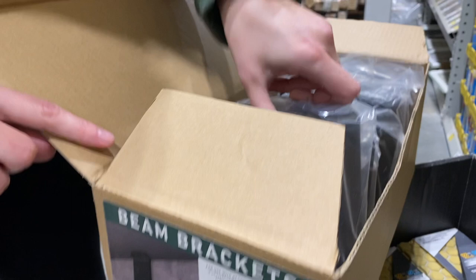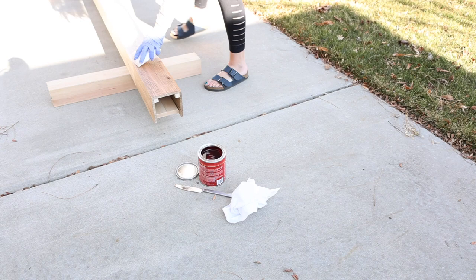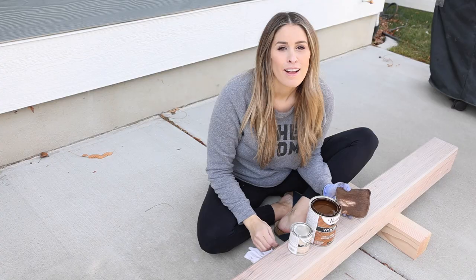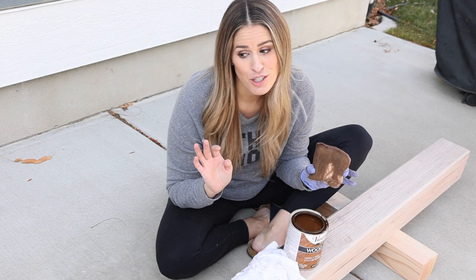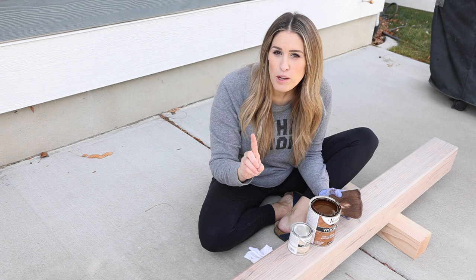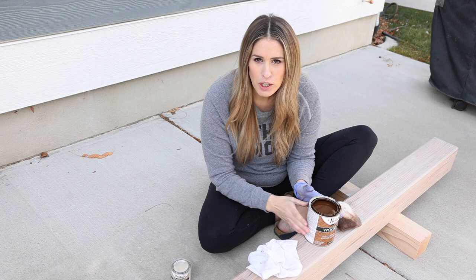I also picked up two of the ornamental seam covers and I'll show you guys what I did with those later in the video. Back at home, I prepped my beams to be stained. I started with a pre-stain wood conditioner, applied it with a sponge, but you could also easily do it with a rag. Let me show you guys the process I used for staining my beams. I tried this color combo on another project I'm working on for Hill's House and decided don't fix what's not broken, so I'm going to use the same color combo on my beams. First, I took my sun bleach and rubbed that on with my sponge and then quickly removed it with my rag. My next step is taking my early American, rubbing that on with my sponge, and then again quickly removing with my rag.